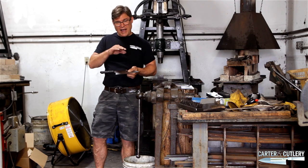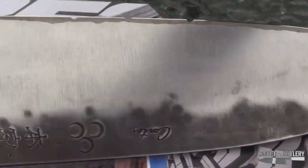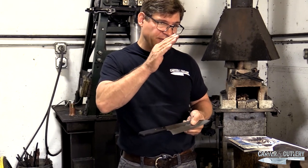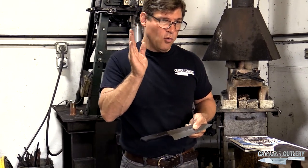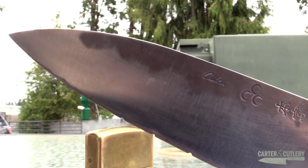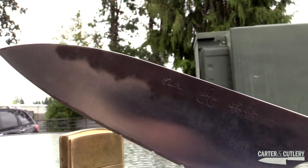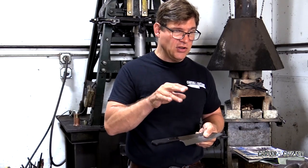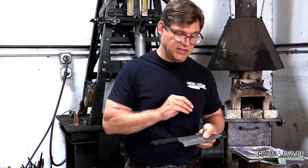In the light, I can see that around where the blade chipped, the steel is slightly deflected. It's like the steel got flexed past the point where it couldn't withstand it anymore and it chipped out, but part of the steel around it stayed flexed. So that means we have the perfect combination of hardness in this steel and toughness and flexibility.